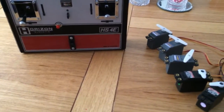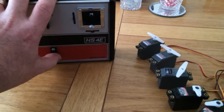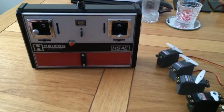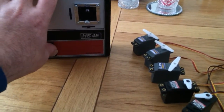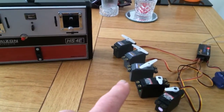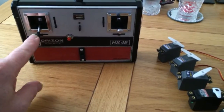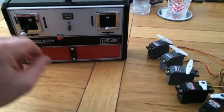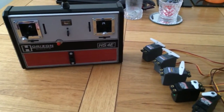There's one little feature that's quite nice. If you turn the transmitter off and accidentally leave the throttle anywhere other than right at the bottom tick-over, when you turn it back on you get an audible alarm and the throttle servo goes to minimum. The throttle doesn't actually work until you put the throttle stick right to the very bottom, including the trim, and then the throttle works again and the alarm stops. That's just a little safety feature I've built into it.